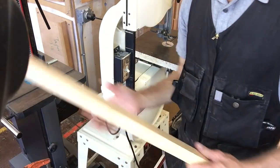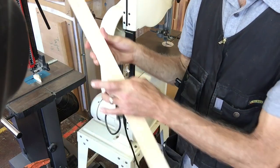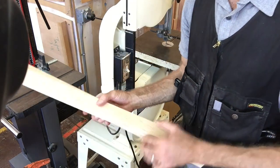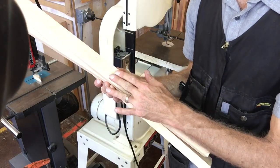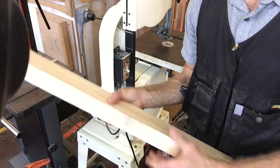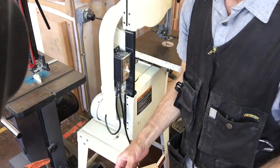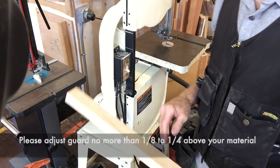Once you've got those rough lengths created and you've planed them to size — which should match the template — and the thickness we're going for about one and a quarter. You might have seen on mine I had a spot that's just barely gone now; I'll sand the rest. Mine are more like one and three-sixteenths, but it should be just fine. You'll have those planed down in both directions; everything should be equal. You'll have traced your templates, and now it's time to get your rough cuts on the bandsaw.